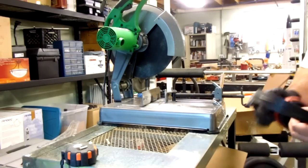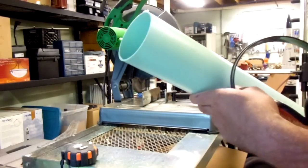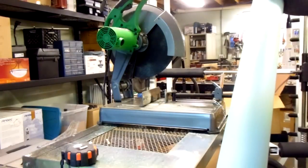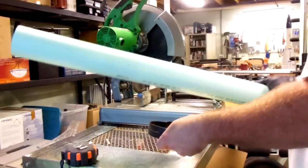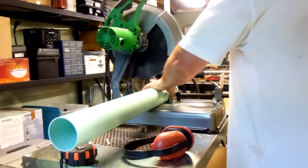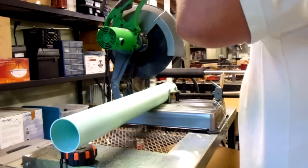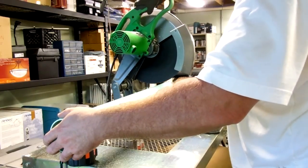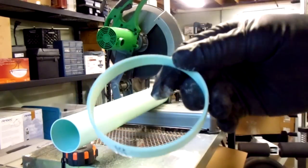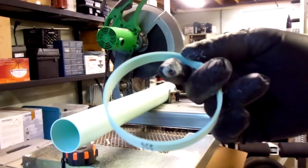Here's a bonus video segment: I just got this new metal chop saw for some metal fabrication I was going to do as a hobbyist, and I was curious if I could cut PVC with it, because cutting larger PVC with a hand saw is kind of a pain — it's hard to get it straight, and you have to clean off the burrs with sandpaper. I did a quick search online, found a few guys that said they did it, so I tried it out and sure enough it works. Use your eye and ear protection — it's pretty loud and dangerous, a definite widow maker, keep your fingers clear. As you can see, there's a very nice straight clean cut, no burrs at all, and it saves a ton of time over trying to mark that big pipe and do a manual cut.